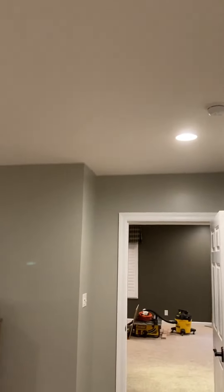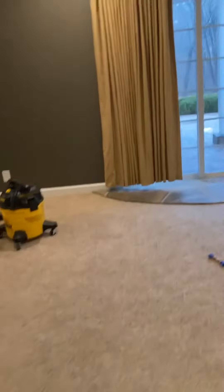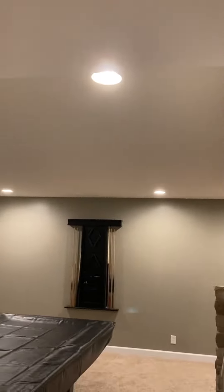So that's three. I'm not quite sure without cutting into the drywall, but this room is cold and just has the one vent. All the joists are running the right direction for us, so we're able to get another one in this room, maybe closer to the door. So that would be ideal — an extra four total. This pool area I'm just not sure how to get across, so I'm not going to make a commitment to that room, but at least add four and increase the size of the furnace to get some extra heat in this living area.